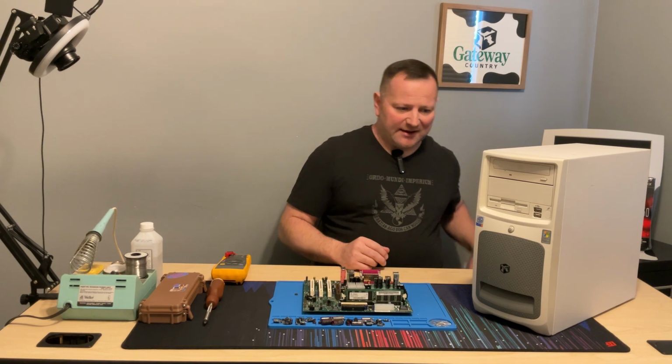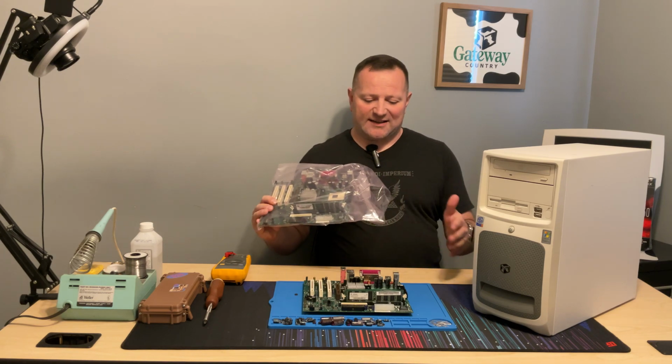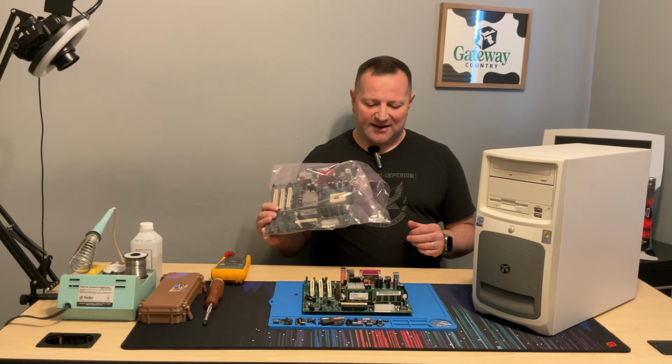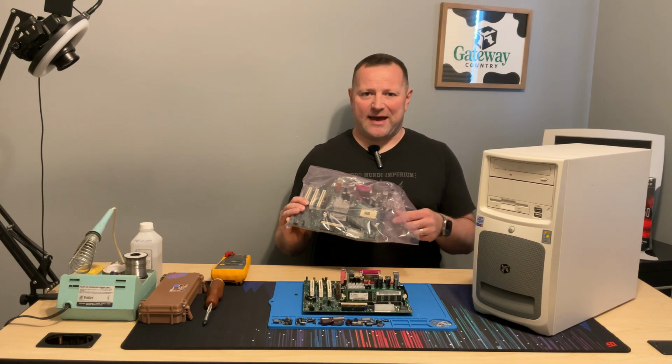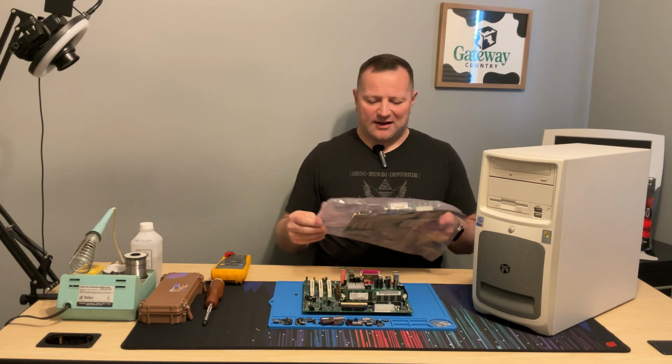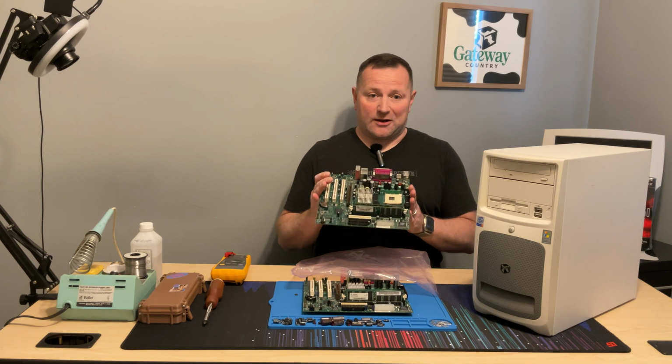Luckily, I was able to get a very cheap board on eBay, and this is actually what I used to test back and forth. Since I don't have schematics, I basically just kept measuring continuity until I found something that didn't match. And it didn't take me too long. I started with the MOSFETs, so it was pretty quick, and I have a working board.